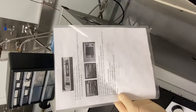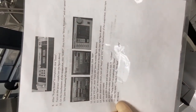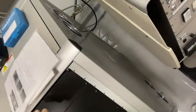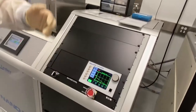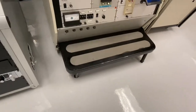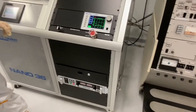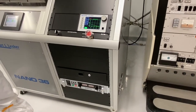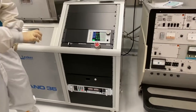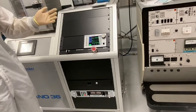This machine is really cool because it's all automated. Normally I have to manually turn on the rough pump, watch the gauge, and when it reaches a certain level, turn on the turbo pump, open the gate valve manually, and do all of it myself. Then during growth, I have to sit there and manually adjust the voltage and current, watch the quartz monitor, keep adjusting, watch the vacuum, and do all of it by hand — sometimes sitting for a couple of hours. But this machine does everything completely automatically.